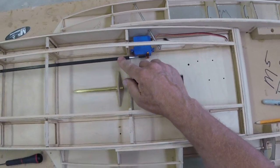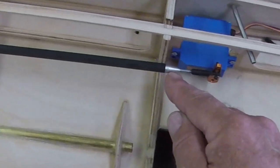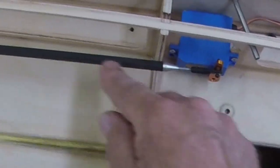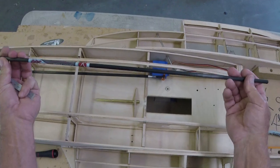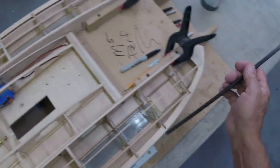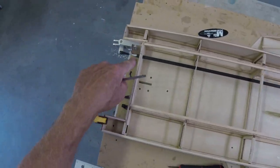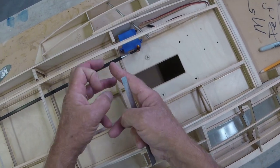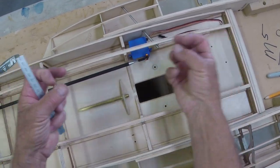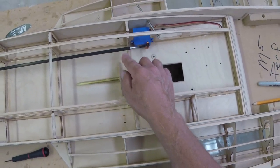These are glued in with G10. Oh, by the way, where do I get mine? These are not from Zip Kits. Zip Kits one, I believe they're a little bit smaller diameter. It uses a smaller rod. Because I'm cheap and I don't want to go buy any, I use free stuff, free, wonderful carbon rod. I use free rods and I make my own. These I make on the lathe. They insert 3/4 inch. And then there's grooves cut in them so that when you epoxy this thing in there, it has a place to capture epoxy. I use G-Flex for the installation of these also.